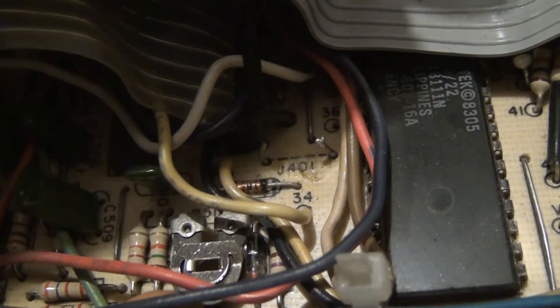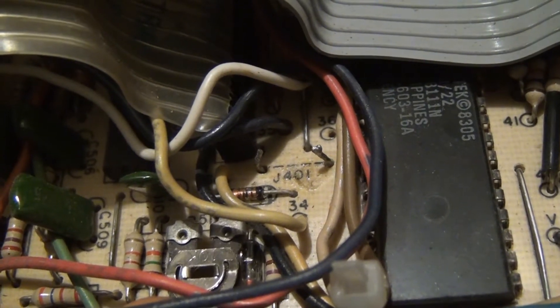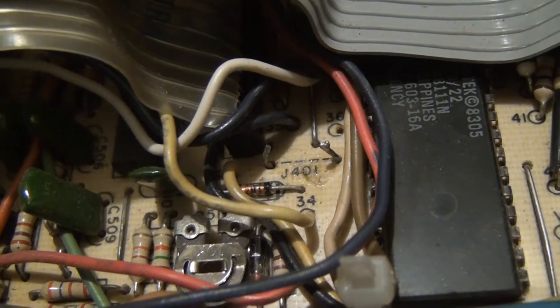As you can see, my pins have been bent quite a bit and they were actually loose in the board. I ended up having to flip it over and re-solder those pins from the back before I was even able to program it.